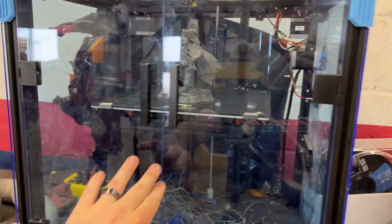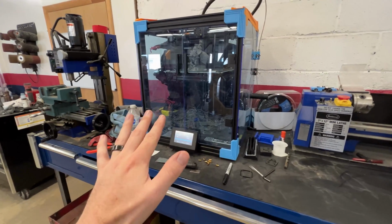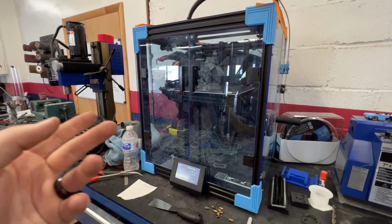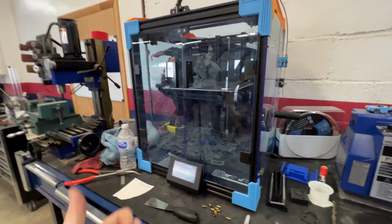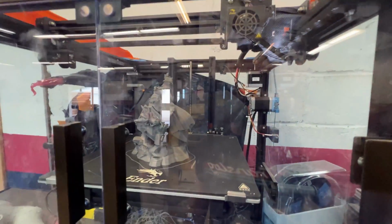Ender 6 is a phenomenal piece of machinery. Again, for an entry-level printer, it was a little finicky to figure out, unlike a Prusa, say. But once I got dialed in, I'm actually very impressed with it. And I've done other materials that were higher grade, like ABS and ASA, and it worked out pretty okay. You have to put a bag over the top to keep the heat in. In fact, the print is finished, so that's pretty neat.